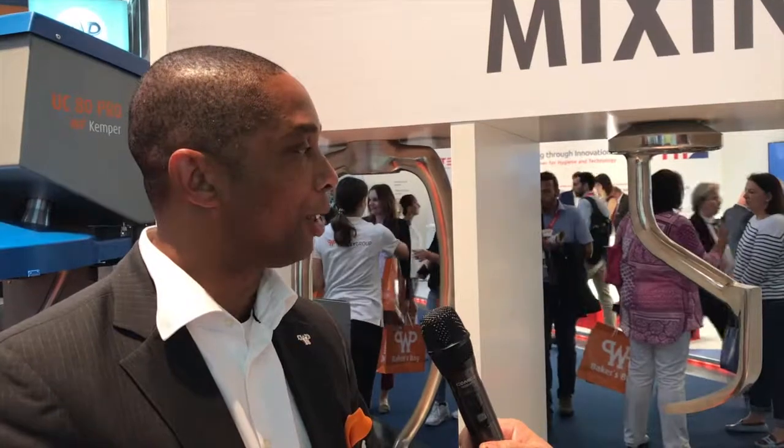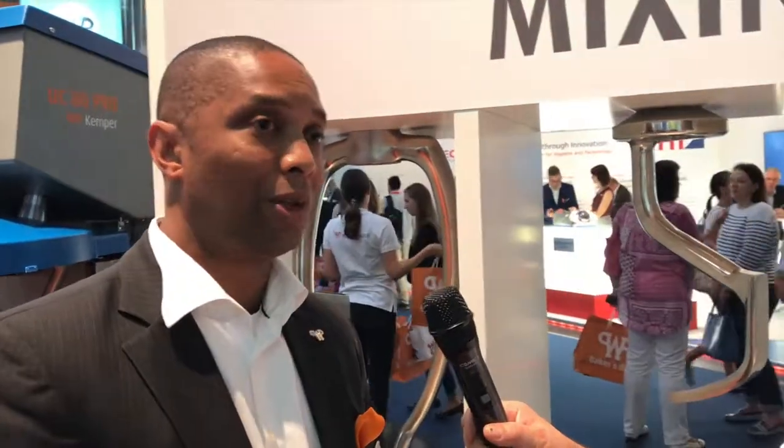When we searched for a rye mixer we discovered it actually has a special panel design. This was designed to replace the elliptical mixer — the hockey stick mixer that was made many years ago. For rye mixing you need a very slow action and slow development of the dough. If you have something like the spiral, it's a little bit too aggressive. So we made this tool, available in all sizes, which gives you the slow development designed for rye above 60% rye content — so anything from 60% to 100% rye.